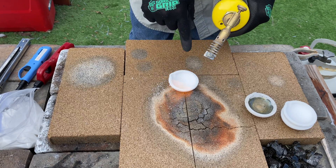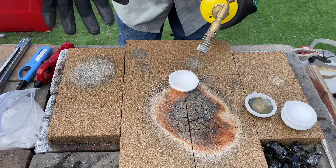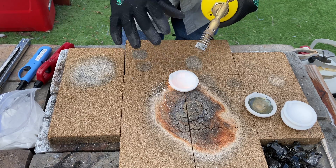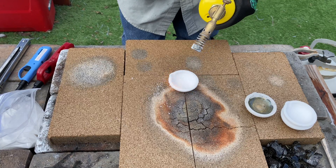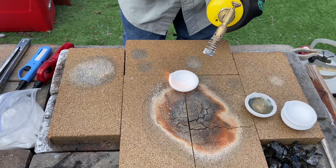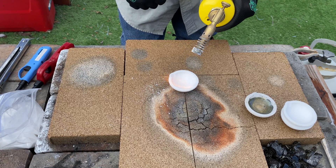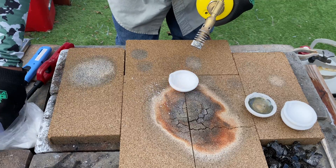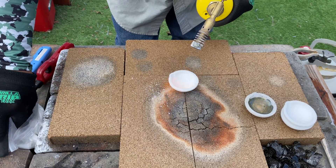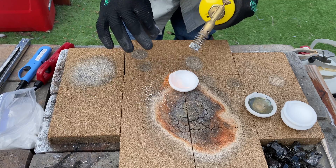I pour it more on the outside because the borax will naturally slip down to the bottom or the center of the dish. But what's really important to remember is that we get enough glaze on the part that we pour out. Otherwise, when we go to pour out our gold or silver, it can get stuck to the crucible.